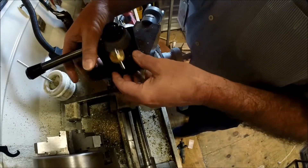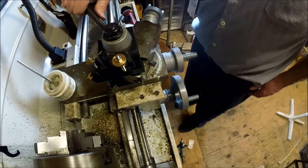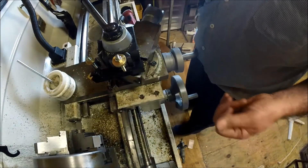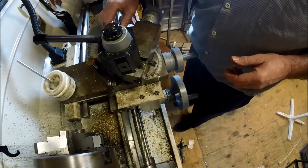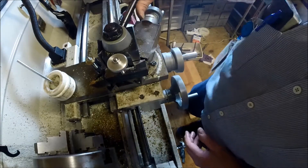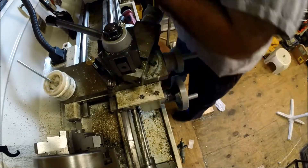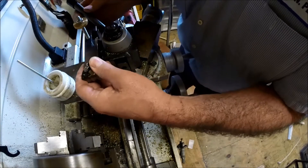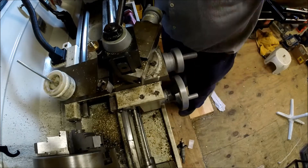I've got to add some extra mounts. Now it does rock. I centered these tools — see, it just locks right up. You've got it mounted on the dovetail just as firm as you can — you can take as heavy a cut with this as with any other tooling, standard put-on tooling. I always check my center depths on these. There's the VNMG, and this is the Trigon. I set my machine up with my background in CNC lathe machining — basically hard turning.